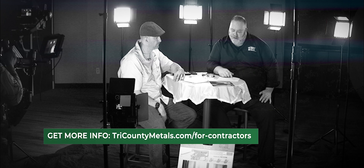Where can you find pitch information? Pitch is critical when it comes to installation because there are certain requirements once you start getting into the lower slopes. Just be diligent about knowing what the pitches of the roofs you're working with are. And if there are multiple pitches on a roof, it can make a difference — you can actually use two different panels on the same roof to meet the pitch requirements.